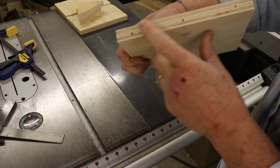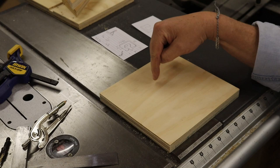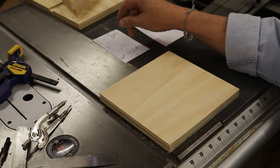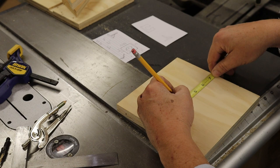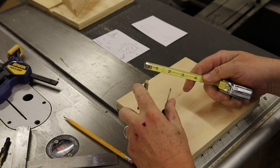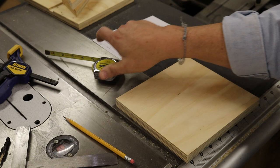I've got the bottom and back marked, so I know which side is the front. Now I'm going to trace out the pattern for the weed eater and cut it out on my scroll saw. When I measured my weed eater, I found I need the center hole to be three and a half inches in diameter and a slot about two inches wide to get it in. I'm going to center the main hole three inches out from the back, draw my circle using a compass set to one and three-quarters radius - that gives me a three-and-a-half inch hole - and mark the center.